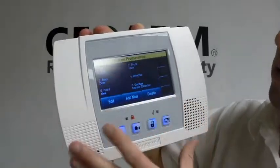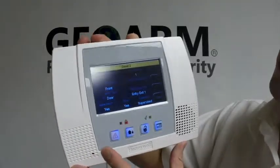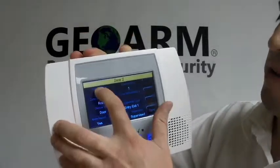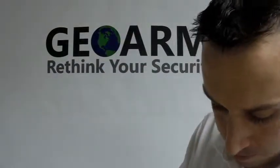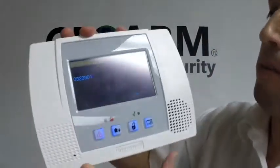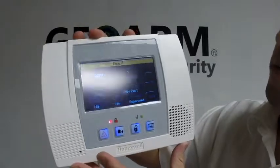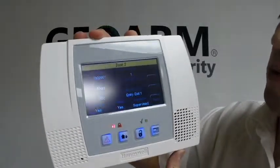And you're going to pick Zones. From here we'll program it into zone 2. You're going to hit Edit and put your serial number in here, which is a seven-digit serial number. After you have your serial number in, hit Done. Now you have to make sure that you have your loop in correctly — the loop number for this is going to be loop number one.